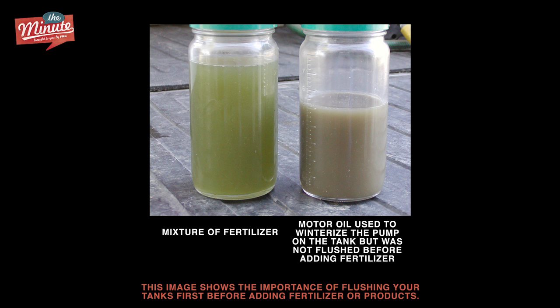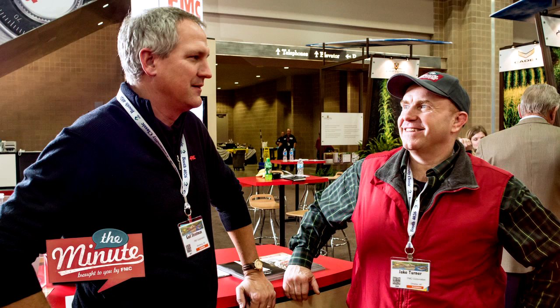Make sure you check all the screens, the sumps, the lines, because as you start working in the spring and start putting products in there, they may dissolve some of those products, or just moving through the field can jar stuff loose. Then we've got things floating in there and starting to clog up screens. So make sure you do a thorough checkup on that sprayer system, or on your planter if you're going to be applying at-planter and furrow insecticides, fertilizers. Make sure that's all clean and ready to go so that you don't have issues getting started up, because it's so critical for growers to get into fields in a timely manner.